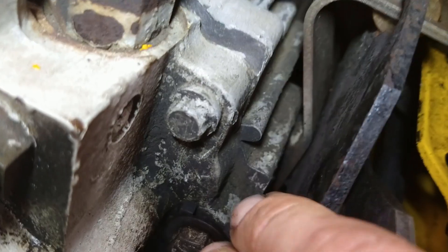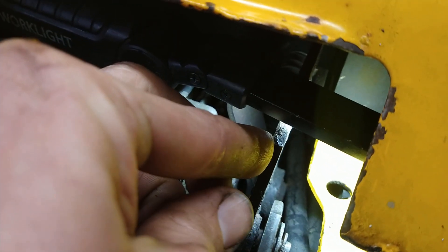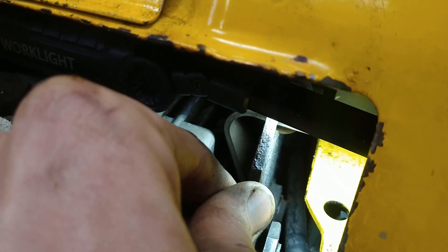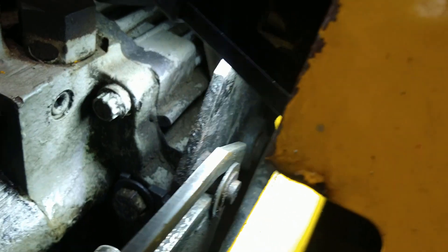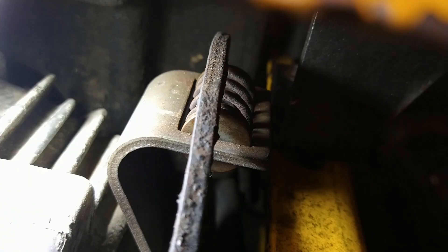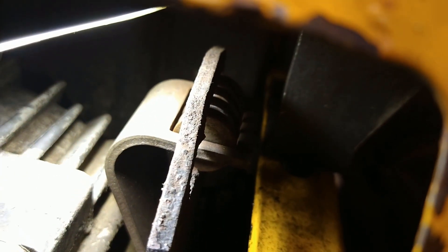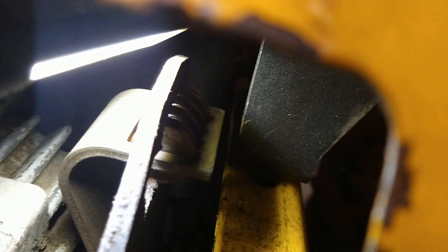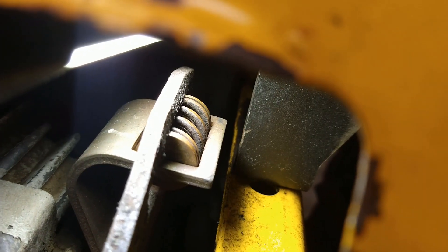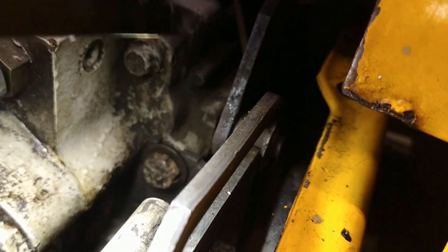The three areas to check: you have a pivot point here for this control plate, and another pivot point for this control plate — that should be pretty much centered with those springs and buttons, and it is not at all. There's a pivot point down here for this one that is extremely sloppy; it can sit like 15 degrees off. The third area is the actual slot in the control mechanism here, which wears out, and you'll get a bunch of wear at the ends and these springs won't slide properly in there.